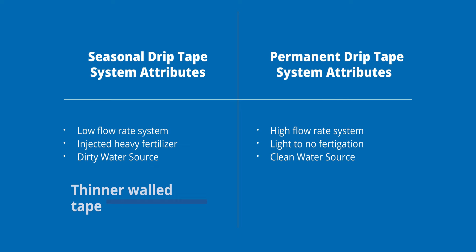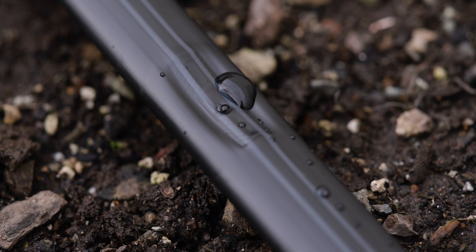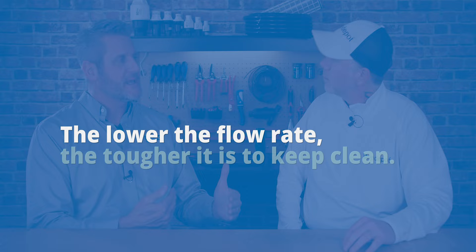Plus, we're just dealing with dirty water, where a water source can be coming from a canal, which came from a river, which was fed by a mountain — silts and things like that. So they're trying to evaluate: do I try to keep this tape, knowing that I have some plugging in it, and how would I manage that in next year's crop — versus just buying brand new product, starting over from scratch, having a completely clean slate in my flow? That's why we make a lot of thinner mil stuff — some 6 mil, 7, 8, and 10 mil product — so it allows them to start over every year from scratch. These are very expensive, high-density crops, and they usually tend to be a very low flow rate. The lower the flow rate, the tougher it is to keep clean. So it becomes that break-even point where buying a 6 mil product and recognizing you'll have some plugging means you're better off going into next year's crop with a brand new tape product.